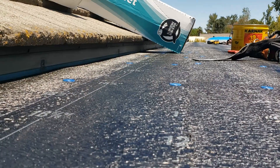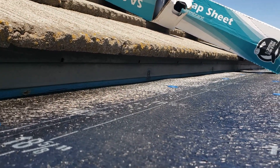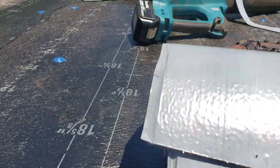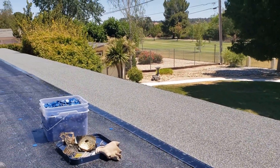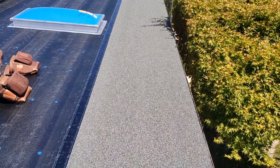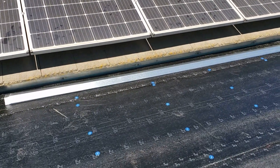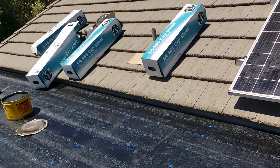Let's go up the ladder and take a look at the roof. There's an edge metal, and we left enough room to be able to slide — where the edge metal laps — we left enough room to slide our flashing in underneath. We've got a two-coat system here: a base coat and a cap sheet. Nice cap sheet walking surface — medium gray, matches the color of the tile roof. Here's the base sheet, all nailed down with nice wind nails.